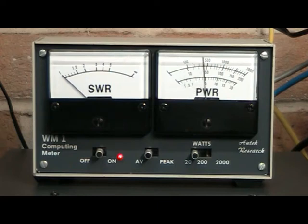This is a little video to explain the meaning of the term 'foundation watts' as I'm heard to use it. Lots of foundation licensees have told me that in their training they've been taught to adjust transmitters for the 10 watt PEP power limit by putting an ordinary directional watt meter or SWR meter with power indication in line, and then talking it up to 10 watts.